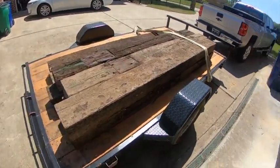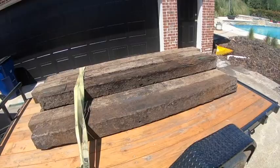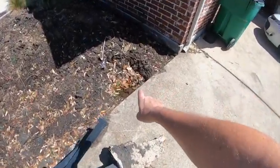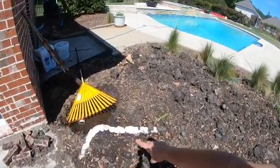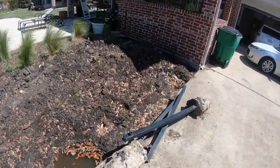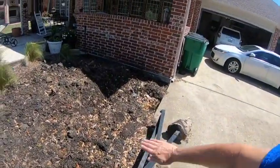A little bit of a learning curve — they're heavy. Those things are like 200 pounds a piece. I've got a pretty good slope here, so one of the things we're going to do — you can see where the old post came out — we're going to have to dig down about that deep. I've got a drainage pipe here that's going to have to be rerouted. I've already started to pile the dirt up when we removed the red tip hedge. But I've got to dig a trench basically about a foot wide, deeper than what I need, and the trench has got to be level.